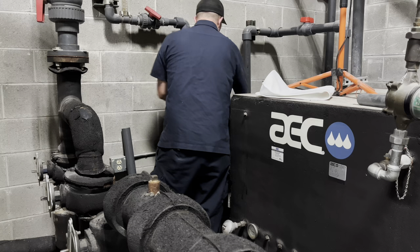Welcome to the vac shack. Our material conveyance system: in the plastics industry we use virgin material and regrind, and 90% of it is pelletized — little pellets like BB's. We need a way to get it from a storage location — a giant silo outside, cardboard boxes, gaylords, whatever — to the machine. The most efficient, best, and cleanest way to do that is via vacuum.